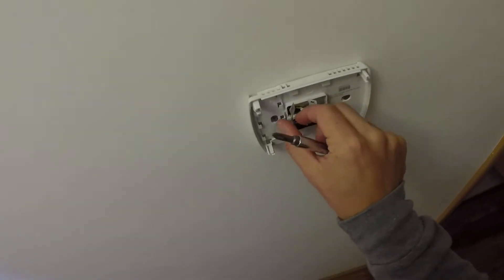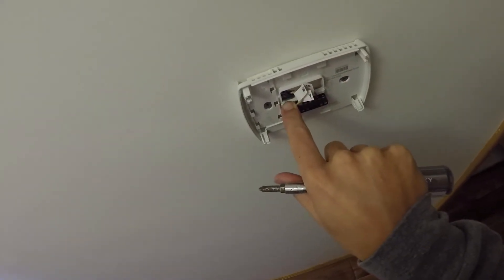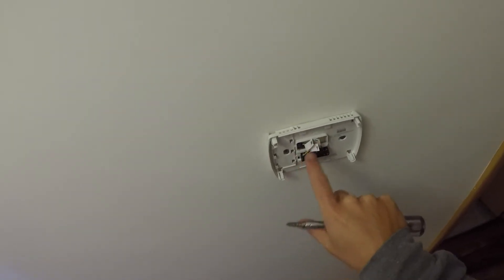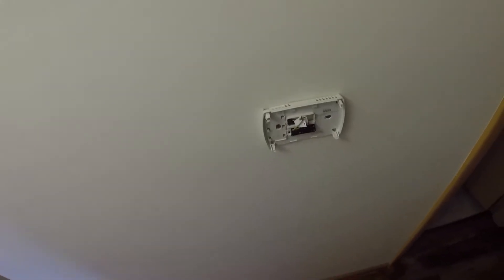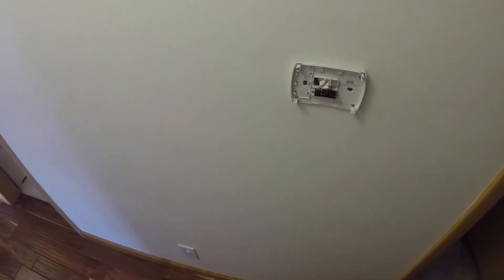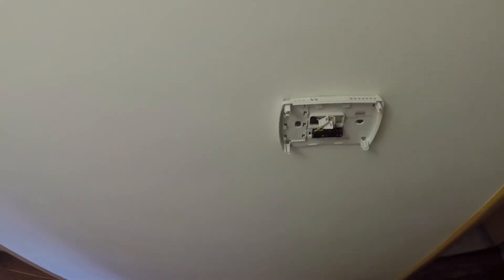To do a wireless thermostat, you're going to need power. So I'm going to steal these two extra wires I have coming up here — that's going to be my power. If you didn't have extra wires, you'd probably have to run a cable through the basement to get a wire up here. Unfortunately, with wireless, you kind of need an extra power cable. I'm going to show you my little trick on how I'm going to do it.